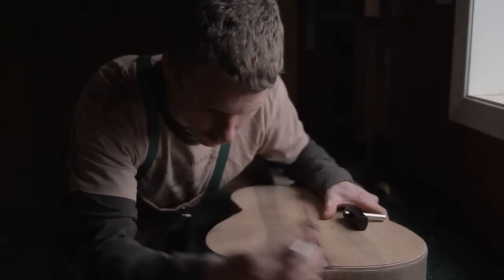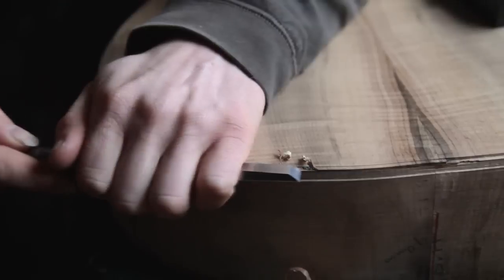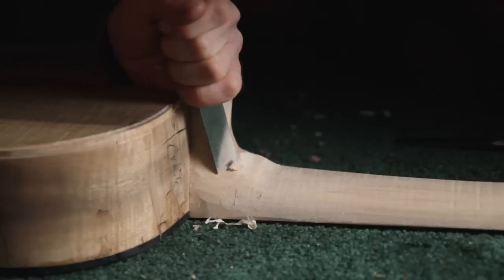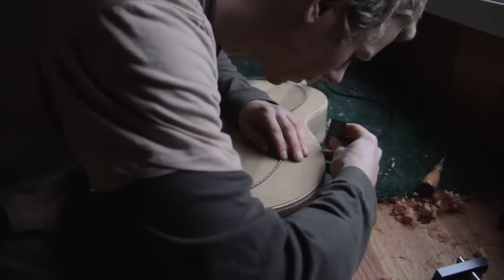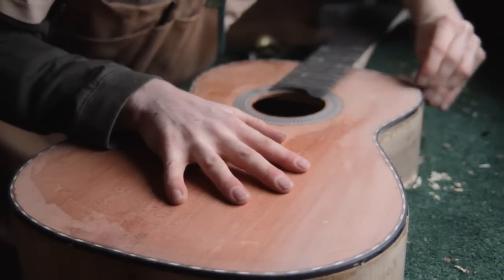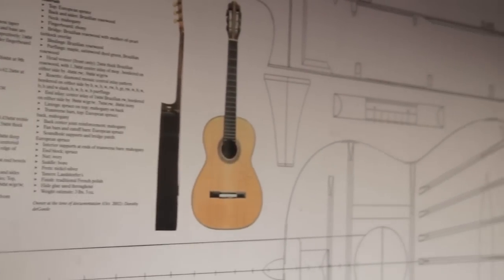In the beginning it's quite difficult to take wood and really know how it's going to sound. But as the years have gone by, I've been able to get to know spruce, cedar, and rosewood, and create a general category of where they'd be. The wonderful thing about using hand tools is that it really allows me to get to know each individual piece of wood. There's so much variation between even two pieces from the same log that it's very vital to develop the skills to feel it, flex it, and know how it should be thicknessed and braced to get the best sound out of it.